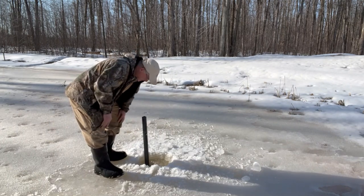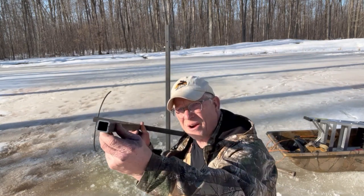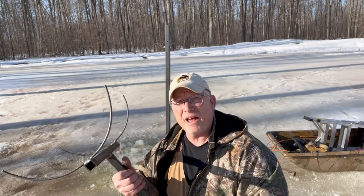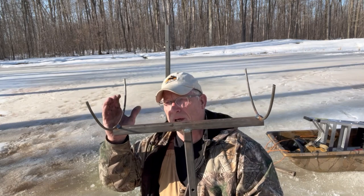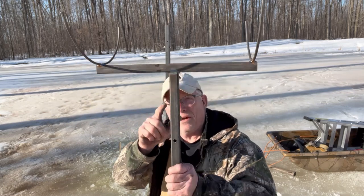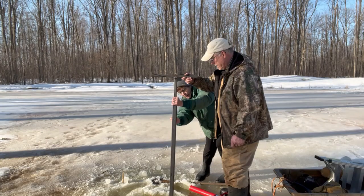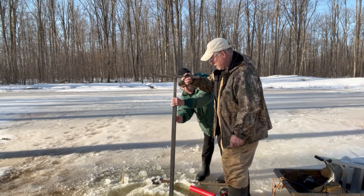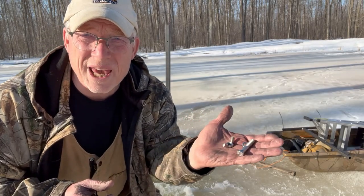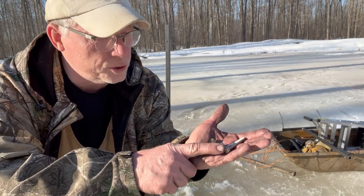This is a problem — too deep. This cradle is one-inch square, made of 14-gauge metal. The post behind me is 11-gauge. These are one-quarter-inch round pieces of solid wire. This is 18 inches here, 30 inches here. We've got holes drilled through it at regular intervals, and this way we can adjust the height of the actual nesting tube. The holes I have drilled are three-eighths inch. I'm going to use this with a lock washer, stainless steel, and a two-inch bolt that goes through.